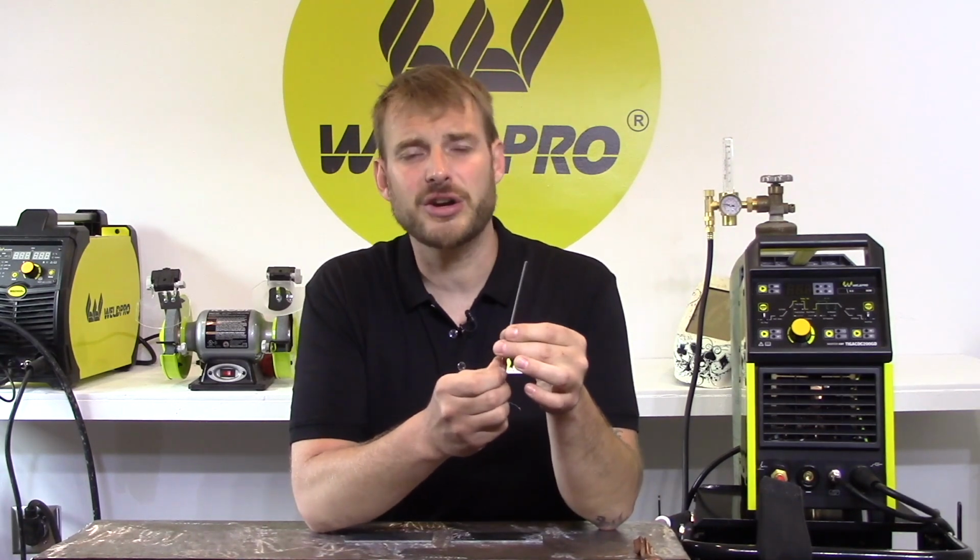If you don't have a drill, that's okay. You can spin the tungsten with your fingers. It's just very hard to achieve that perfect cone. Often it will leave a flat spot or create an elliptical shape on that cone.